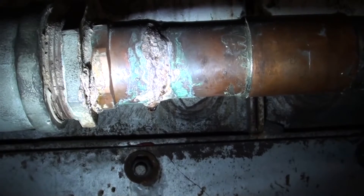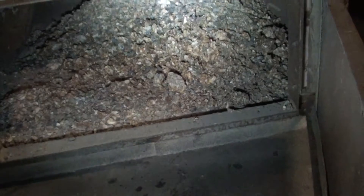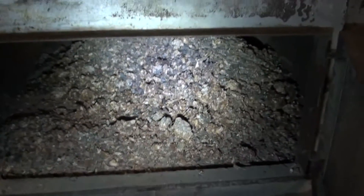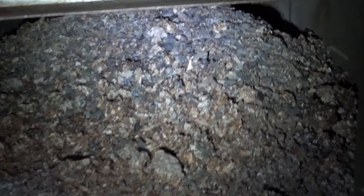It has a handy ash door down here. We do have a water leak coming from right here — we have to fix that, but it's minor at this point. The ash pan door just opens up. Right now there's not much ash in there because we've just started it back up again. You can still see there's a lot of unburnt coal in there, which means it's still not quite working right.